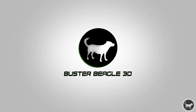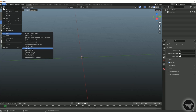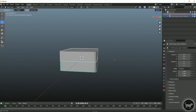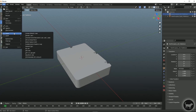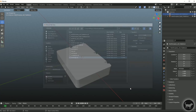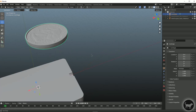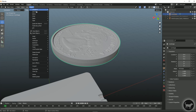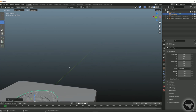I'm going to show a very quick version. Go to File, Import, then click STL. I'll click the two flat bottom versions of the STL — there you have both of them. I'm going to hide one and now import the model I want to make the mold of. For this one I'm using this coin — just a regular mold of a quarter I got from the internet. I'll come up to Object, Set Origin, and set Geometry to Origin.